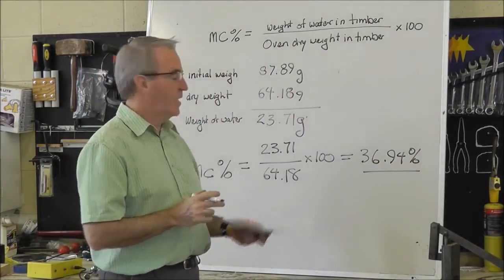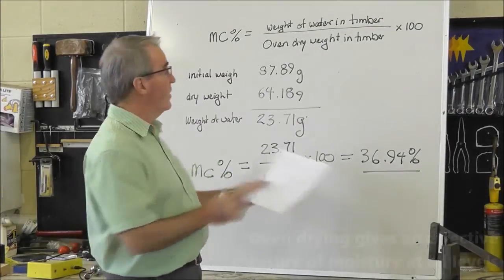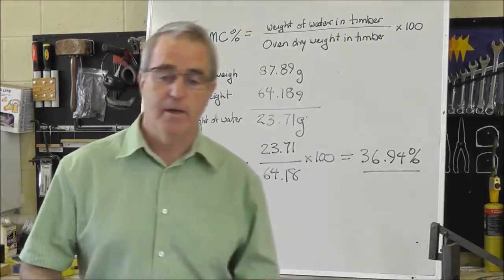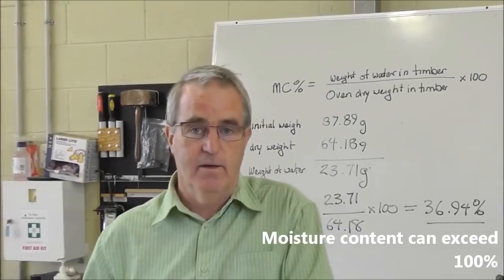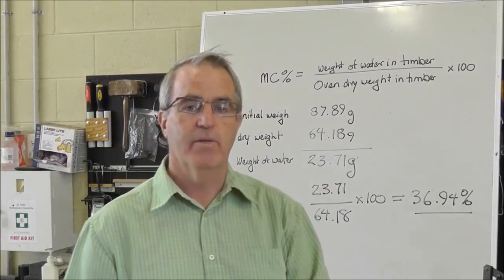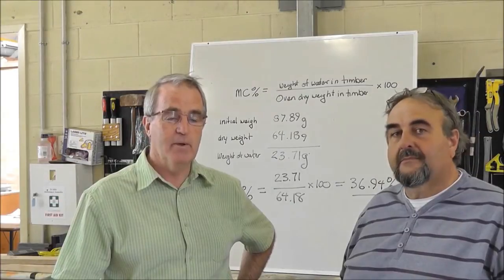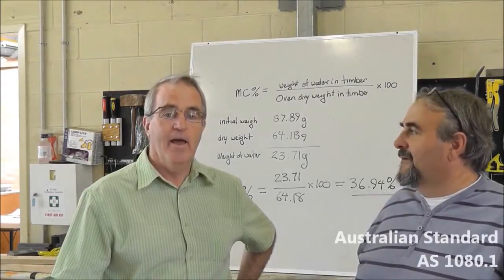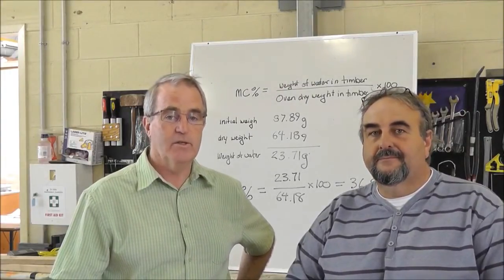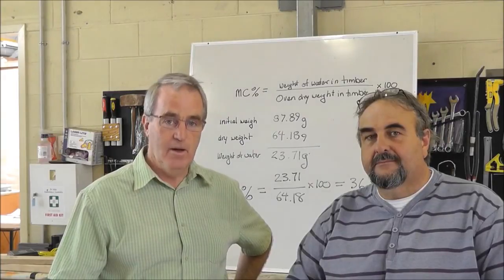What's important is that with a resistance or capacitance moisture meter we can't read these figures, because this is over fibre saturation point. With oven drying we can determine the moisture content no matter what the level is. You've got to remember that in timber the moisture content can be well over 100%, because we can have more water in the piece by weight than we have wood — quite common in trees when harvested from wet areas. Measuring moisture in timber is a very critical part of timber production and sales. It is covered by Australian Standard AS1080.1, so if you control moisture content measurement in your business, you must be up to speed with that standard.